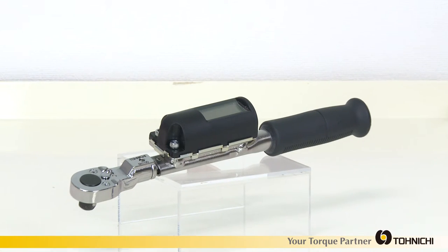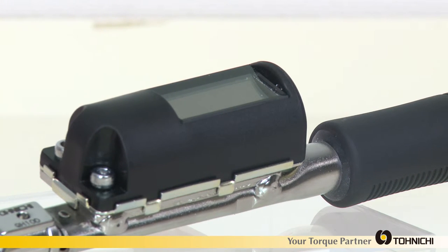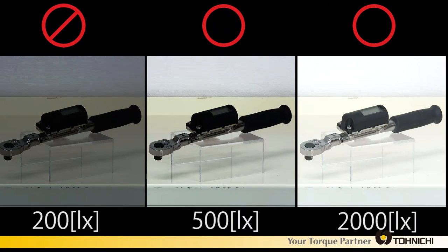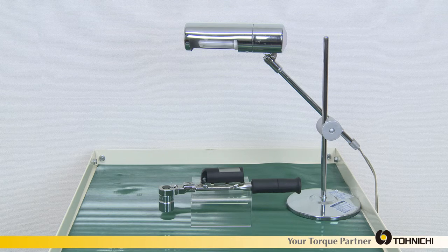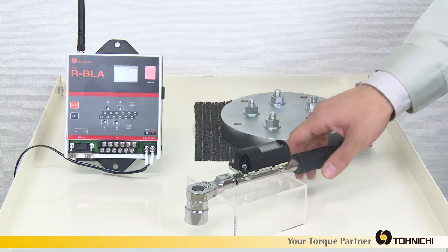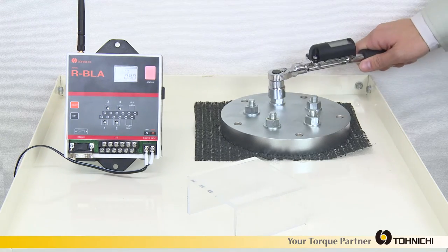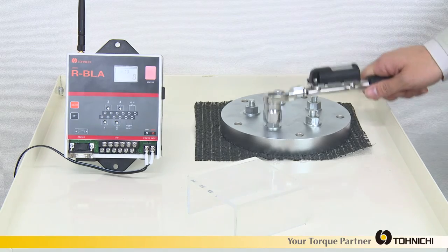While the battery in the tool will never need replacing, the tool must be kept in the light as much as possible to keep the battery charged. BL is suitable for work environments with over 500 lux illuminance available to the wrench while working. We recommend sufficient charging before starting each work shift — charge the BL wrench for at least 10 minutes within 2 meters of a fluorescent light. If your tightening application demands faster cycle times, supplemental lighting can be added to the workstation to keep the battery fully charged.